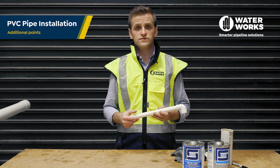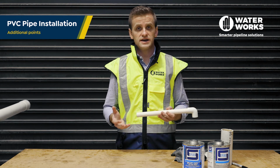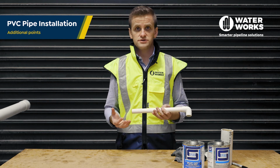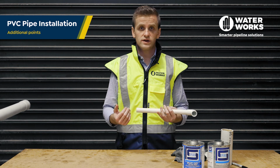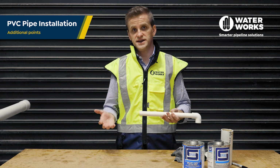Similarly, your working environment should be considered. For example, in hot weather, your primer and cement will tend to dry quickly. Conversely, in colder weather, it will take longer to set and cure.